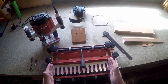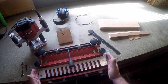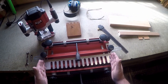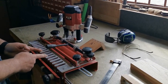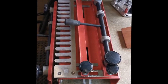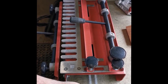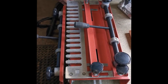The dovetail jig itself comprises various components and most jigs of this type are very, very similar. So this video will explain the methods for any make or brand of dovetail. You've got the standard comb with this one having a half inch spacing. You've got the lock down handles for the two different components so that the wood is held firmly in place. We also have the sliding fingers which give the offset to give the cut the correct spacing for the actual components.